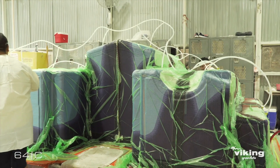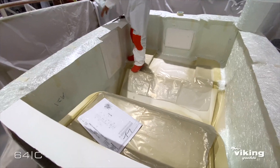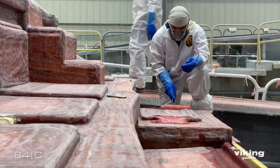That's not to say that infusion is the save-all — hand lamination isn't something that's no longer done; it's still a pretty important part of the whole process. Some areas, like a console seating area, or areas in our deck with the complexity of the mezzanine areas and the gutters — being able to go in there and have the guys who are very talented in rolling out fiberglass roll that out, know you're not going to have air, know that everything is going to be the way you want it to be.